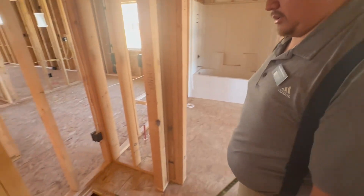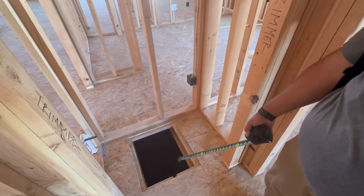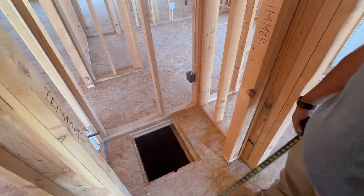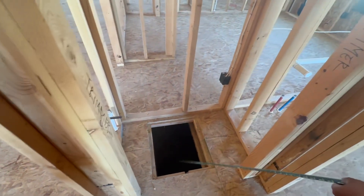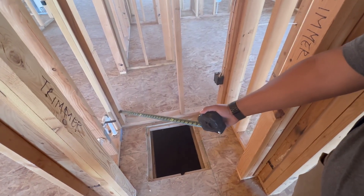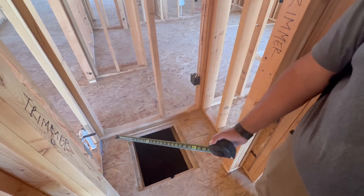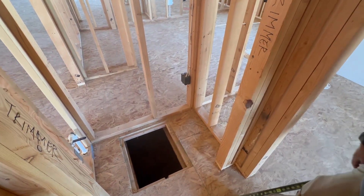Outside your hall bath, we got a closet right here. Inside this closet are two very important things. First is your crawl space access — our construction uses I-joists right here and this is your access to your crawl space. It's pretty good size, about almost three feet deep. The second important thing is your shutoff valve. This valve right here shuts off all of the water inside your home. So if you ever have a leak anywhere in your home, first thing you want to do is turn off this valve. We'll have it in a nice little cover right there for you.